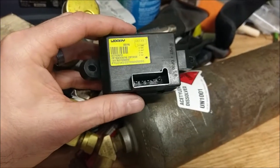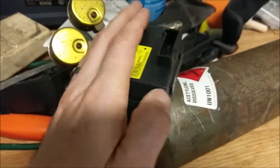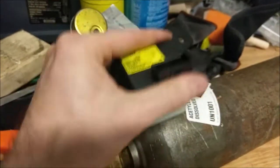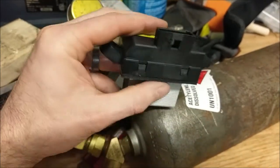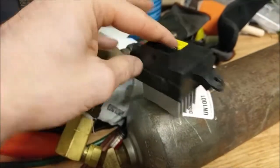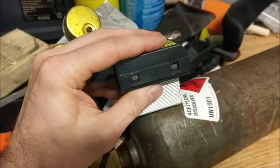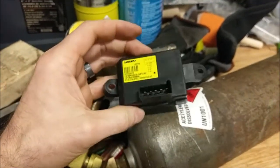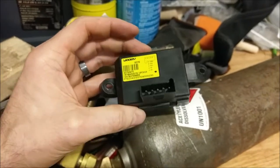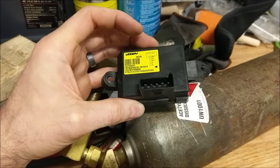So as you can see, I got the pins and terminals kind of lined up. Press them in — they're starting to come through almost in place. The tabs locked in on both sides. This guy should be good to go. Once again this was an intermittent — sometimes they'll just completely stop, but usually they're rebuildable. It's mainly because this terminal and the connector melted.